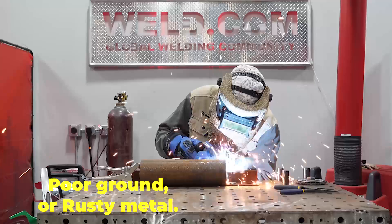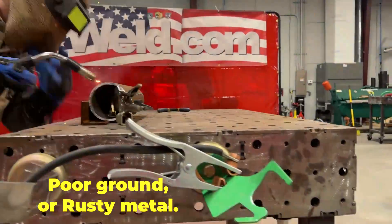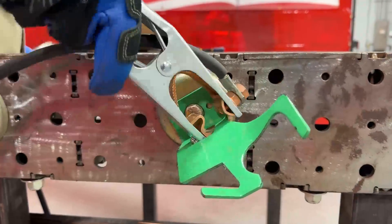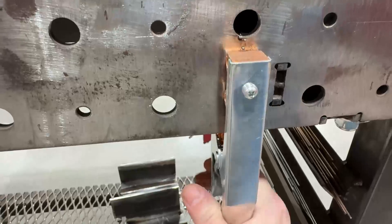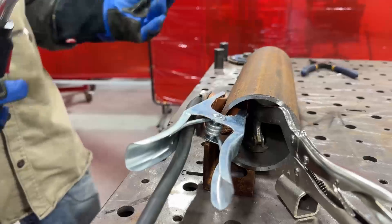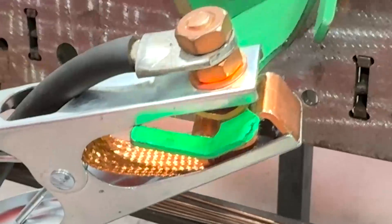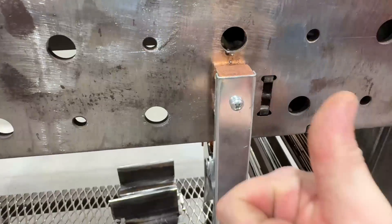You just need a new tip. It's welding, but just kind of rough, and you're going to have that with these types of setups here. We've got a ground that's grounded to just a little bit of steel, not a good solid connection — there's paint on it. So we want to ground either directly to our table here, or directly to our part, which is going to be the best ground you could possibly get. Having good clean connection on both ends is key. Wherever the ground is, if there's any rust between those two points, you're going to have a spittery, sputtery weld. Make sure you have a good clean connection.